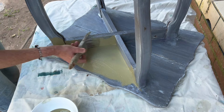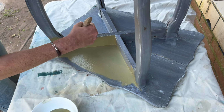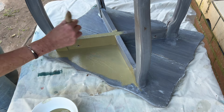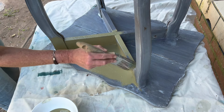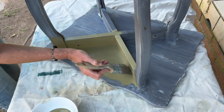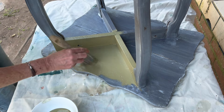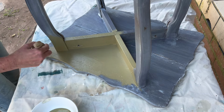Now I go in and just add it over the painted surface because I had sealed this table with a sealer that can take the paint. So it's from the same company. So I did not need to sand down the legs and all of that. You would maybe need to clean it off nicely with lacquer thinners or sugar soap or something before painting, but it was not necessary to remove any of the paint that was there because it was sealed. So this paint goes over the sealed areas just beautifully. And I do end up adding 2 coats of this color.